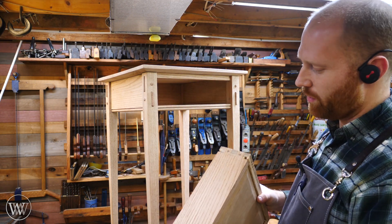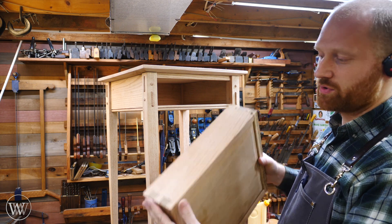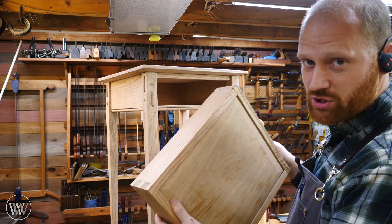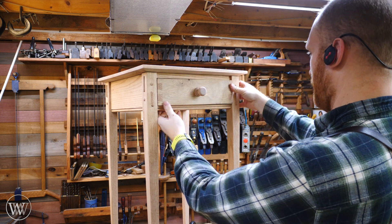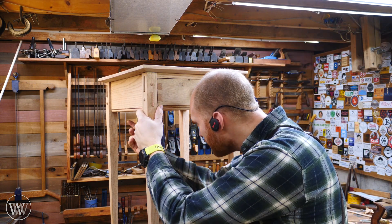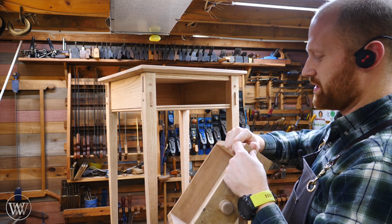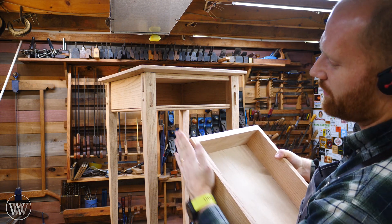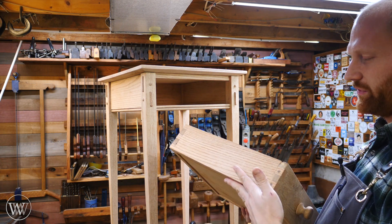So I've put all the pins through the pins into the main board and this is now a solid drawer — no glue, but it ain't coming apart. I haven't done anything other than flush cut them off; the outside of this is all still rough. You can see where the pins and tails stick out a hair more on either side. Actually, that's better than I expected. We're hitting a jam here — it looks tight here and we're hitting the leg in the back. The front face is a little high, higher than the side wall and the back. What I need to do is just taper off the back corner a little bit so it slides past the leg. So I'm going to show you what I do to trim up, clean up, and smooth up these slides.